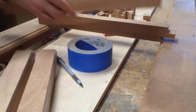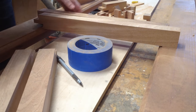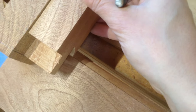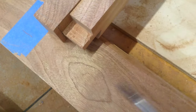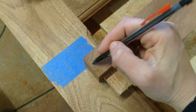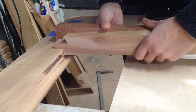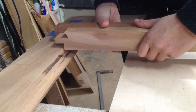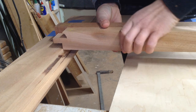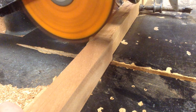You can see my original 18 inches was going to be too long, which is why I do these test pieces. I was lucky mine was too long so I could cut it down. In order to get the perfect size, I cut that profile on two sides and put one next to the other, then I could mark on the edge where my distances need to be. My math was off by about a quarter of an inch, which is quite a lot. But I did the same thing on the rabbet side — I slid these two into place, and where the mortise hit the tail end of my piece, it lined up perfectly.